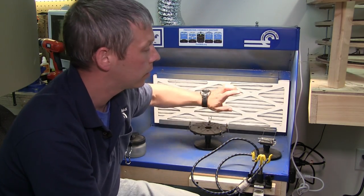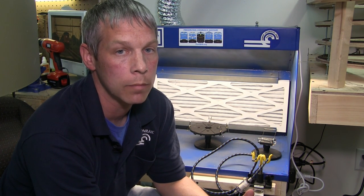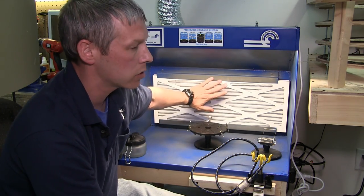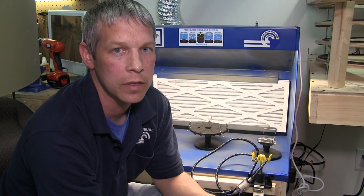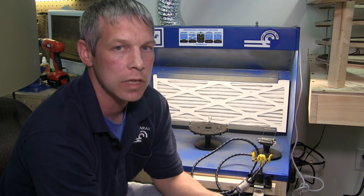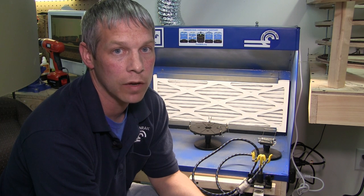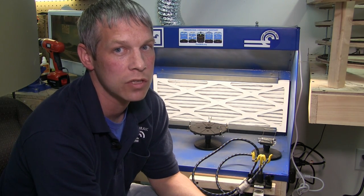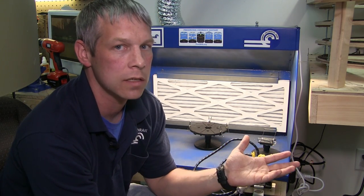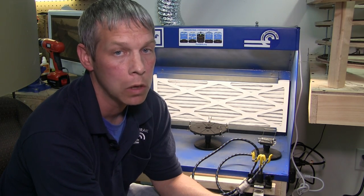The Dayton blower — I went with the Dayton blower because this spray booth was initially designed by Andy Spirino through Model Railroader in the January 1988 issue. Andy designed it to use a Dayton blower that put out approximately 245 CFMs. With help from some engineers they did calculations that at 245 CFMs it would have the proper airflow to make sure no particulate comes back out. Unfortunately that Dayton 245 CFM blower has been discontinued, but Dayton recommends this blower which puts out 235 CFMs. The next blower up was a 400 CFM unit and the price was considerably higher, so I went with this one.